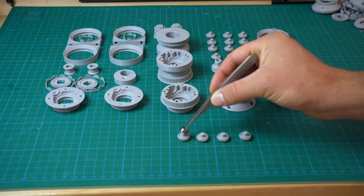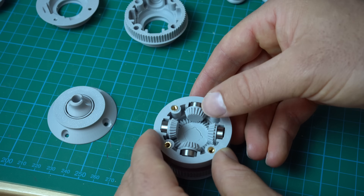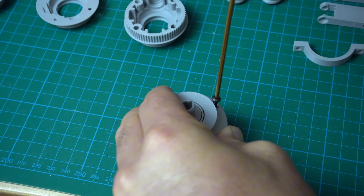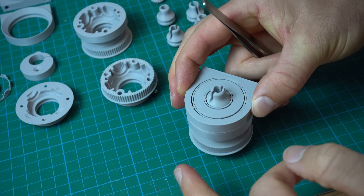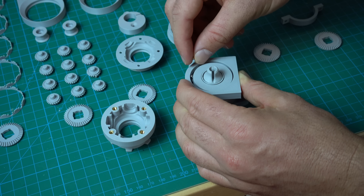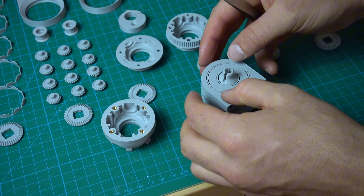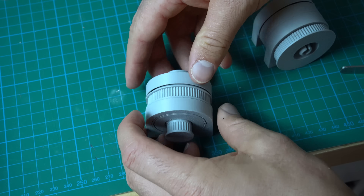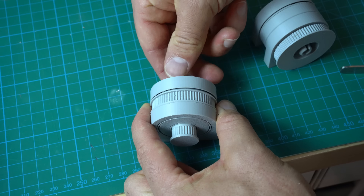I carefully designed all components within all differentials to be 3D printed without support, so they print quickly and the surface quality is excellent. Spreading out all the parts neatly before the build made me feel like a Swiss watchmaker. To finish the differentials, the enclosure is clamped together using threaded inserts and M3 fasteners driven at a slight angle so the screw head can recess and get out of the way of the outer bearing race. The spider gear bearings are held in place by the opposing side of the differential after it's screwed down. I tuned that clamped fit over numerous iterations to ensure the right pressure was applied to the spider gears on the larger bevel gear. The best way to test a differential is to twist one output — the opposite output should rotate in the opposite direction, just like this.